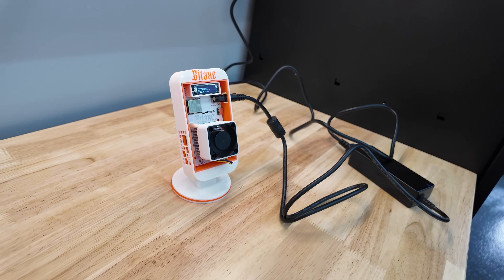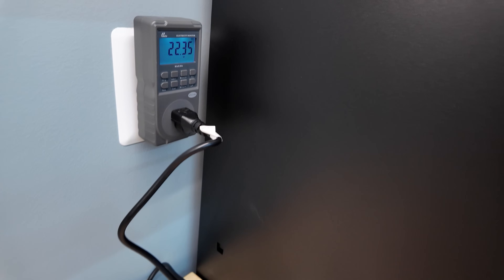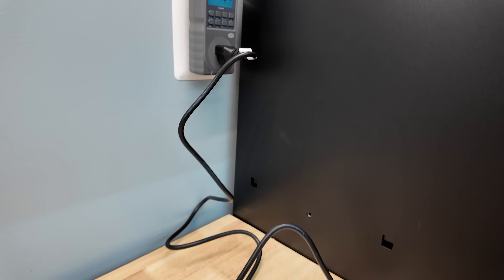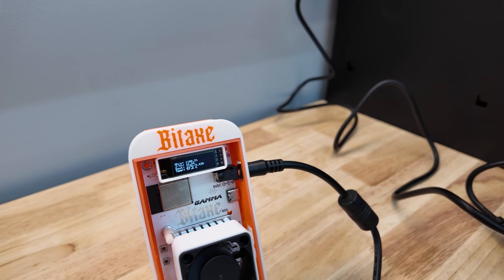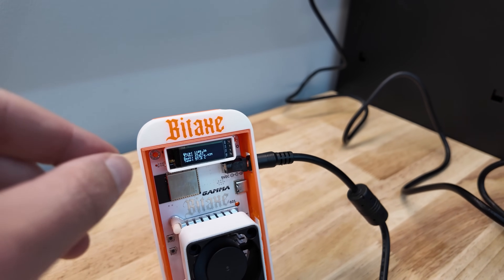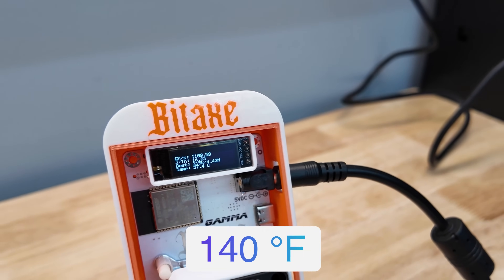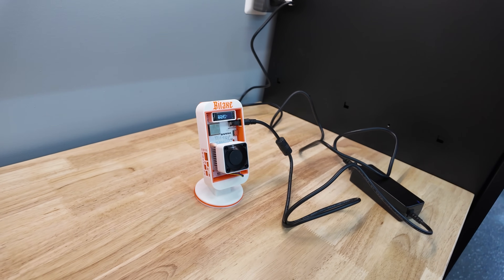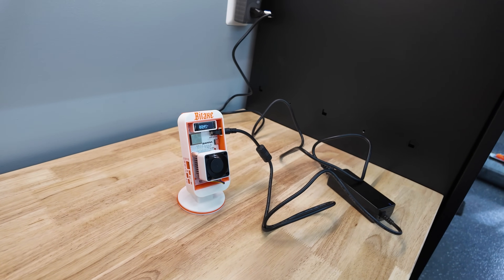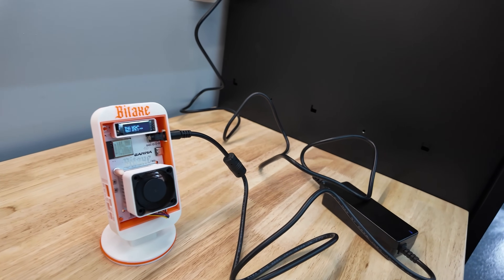On this unit, a fan speed of at least 50% is where you want to be. At 50%, we've stabilized at about 22 watts of power consumption, getting a pretty consistent hash rate of about 1.1 terahash a second, and achieving temperatures under 60 Celsius. The noise is more than I'd like to hear, but it's okay — definitely not as loud as a full-size Bitcoin miner.